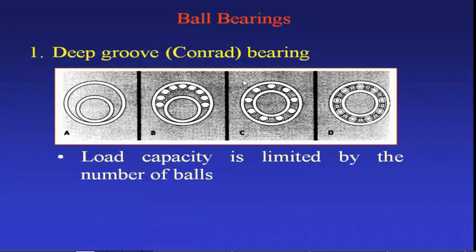The bearing elements — the balls — are the load supporting elements. If there are more number of balls, the gaps can be reduced so that the bearing will be highly rigid and can support maximum loads. But as the number of bearing elements increases, there is a chance of jamming. That's why the number of balls should be optimized — not too few and not too many — in order to get reasonable load sharing and a reasonable life for the deep groove ball bearing.